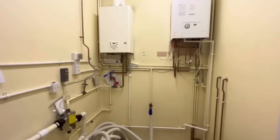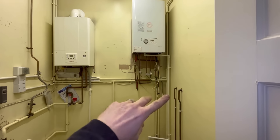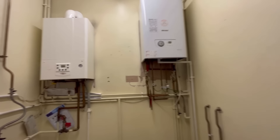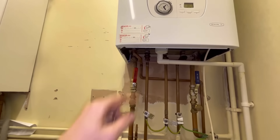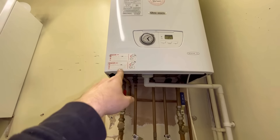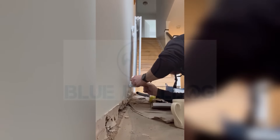This is one of the large properties I look after - this is the swimming pool room. That boiler does the swimming pool, that one does the swimming pool radiators and the pool bar. There's an indoor swimming pool and another boiler in here as well. Three boilers on this one. This one's losing pressure - I've just been outside and tried to feel the PRV pipe outside and yeah it's out there, so it's having to be topped up all the time. I'm going to open it up - it's going to be a PRV, but there's a reason the PRV is letting by.